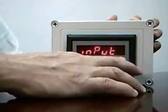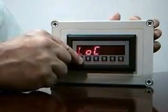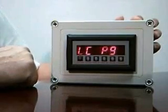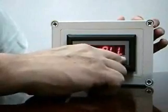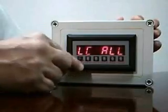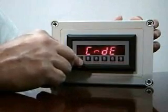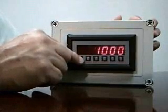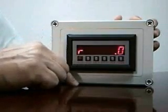Let's go into the next menu. This menu group is called lock. In this menu, you can either have it just lock the program, which will prevent people from getting into the menu mode of the instrument. Or you can change it to lock all, which will block people from changing the set points for the A and B relay — that's the mode we're going to require. You'll also notice that there's a place where you can change the code that's used to lock and unlock the unit. I've predefined my password code to be 1000. By pressing enter one more time, it returns to the run mode.